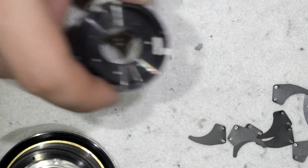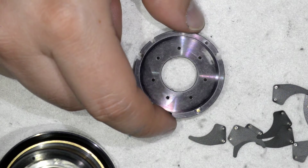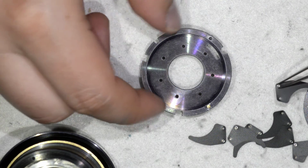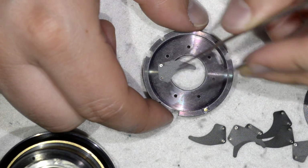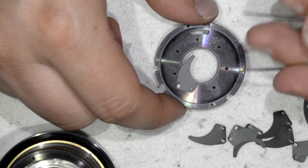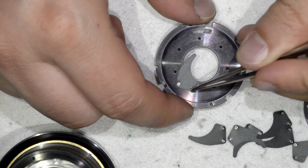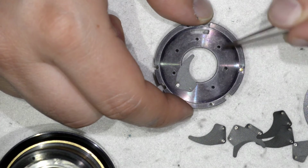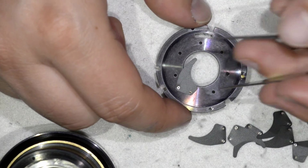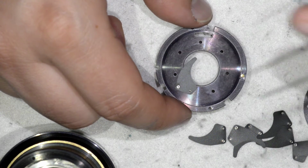the assembly. Then I have the other parts clean, so we're going to start installing the diaphragm. So one thing you need to know is the usual rule of thumb is that the aperture blades need to be mounted in a sense which is counterclockwise, yeah, from your point of view. So here I'm moving counterclockwise.